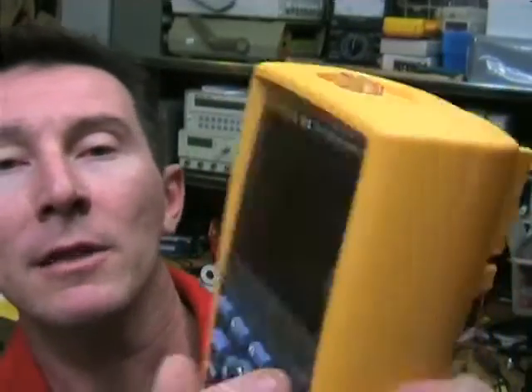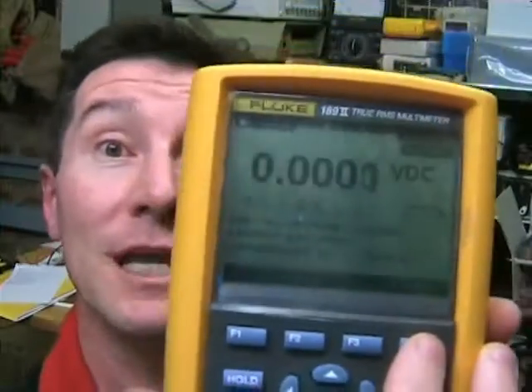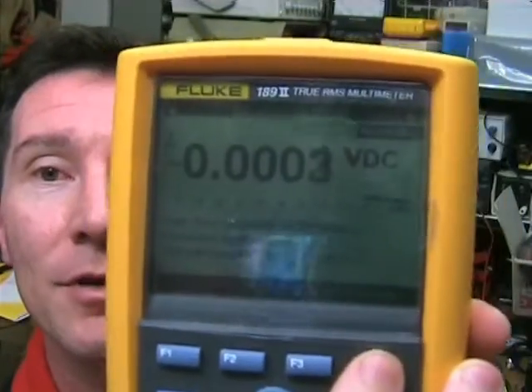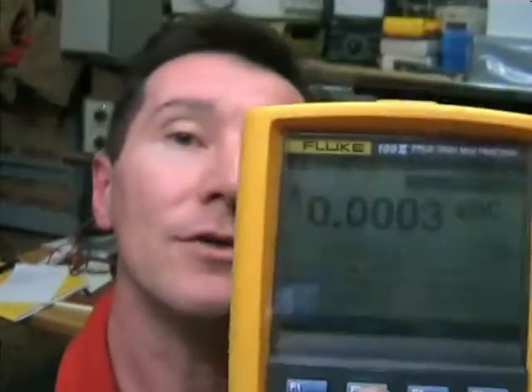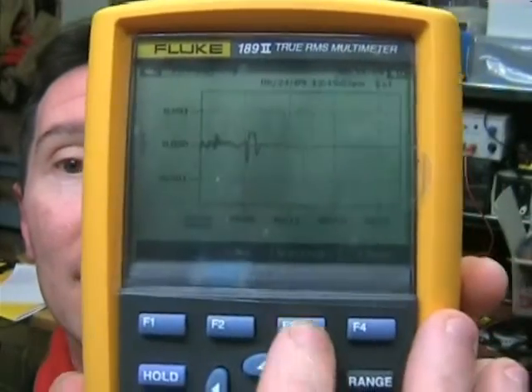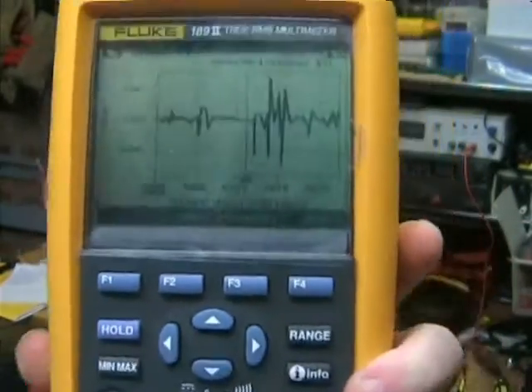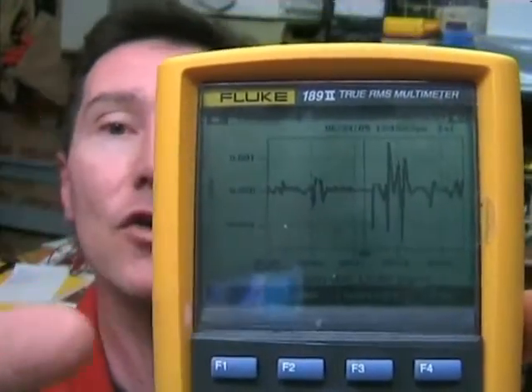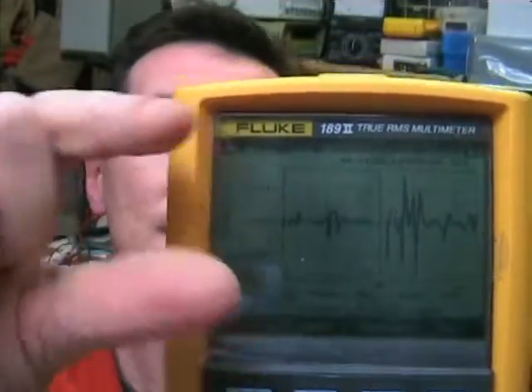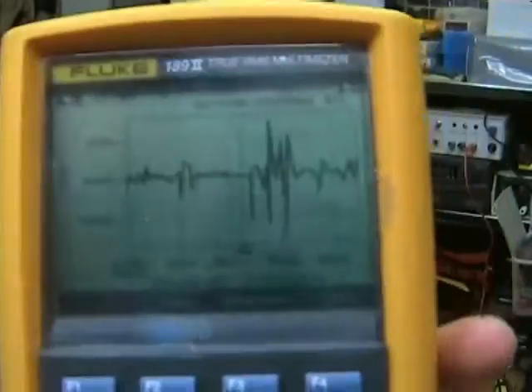You can even let it go all the way through. It's showing that it's got two hours and 40 minutes of sample time left, so that's quite a lot. So we'll actually stop it. Then it comes up with either save or trend. You can save it for future upload to the PC, but I'll hit the trend button. Bingo. There's the data which we just captured. And of course there's noise there. It's zoomed right in, it's actually auto-scaled vertically. And that's plus minus .001 volts - plus minus one millivolt. It's really zoomed right in.